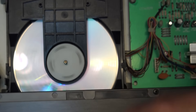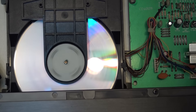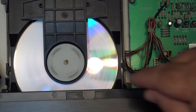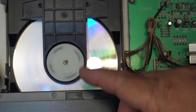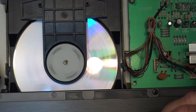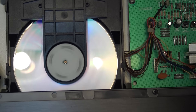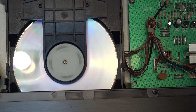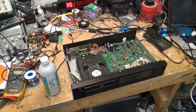Player fixed, even on the worst disc! If you do your alignment to one of these discs you'll generally have the best results - or a defect disc. They used to sell defect discs that actually had defects built in for alignment purposes, with burst errors and such. These 52 times discs, as bad as they are, can usually be made to play with careful adjustments.